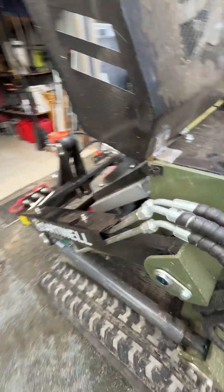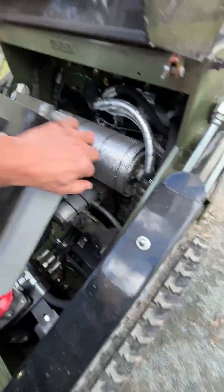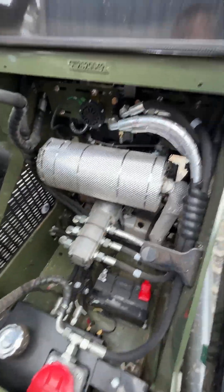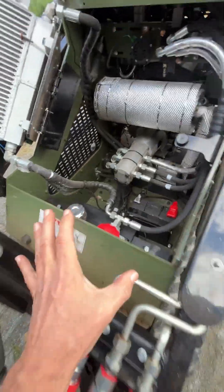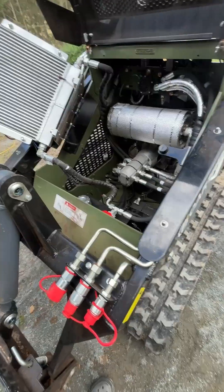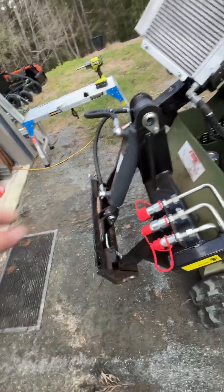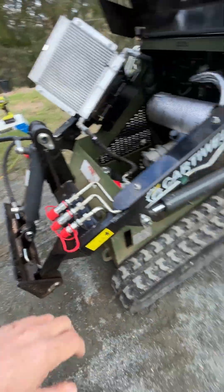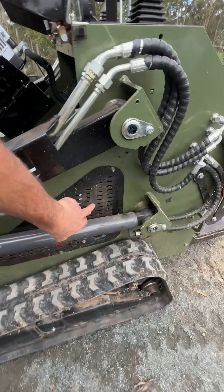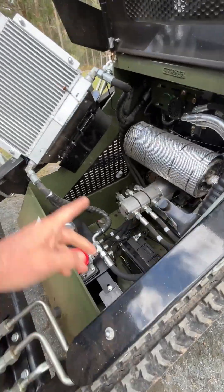Have a look at the dust — the outside of the machine is pretty dusty, you can see up here. But inside my machine it's nice and clean. The components aren't dirty, the top up here isn't dirty. Most of our dust is generated up here in front, so by pulling air through the machine and having it exit out through the front, we're pushing the dust away. You can see on the side we're getting a little bit of dust forming on the outside where it's drawing in extra air.